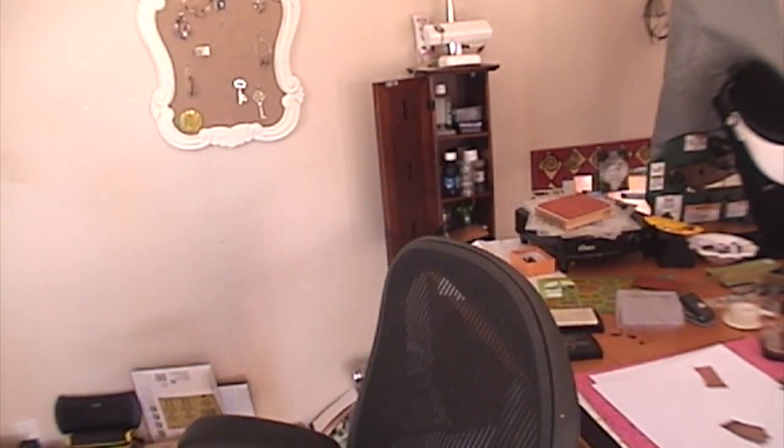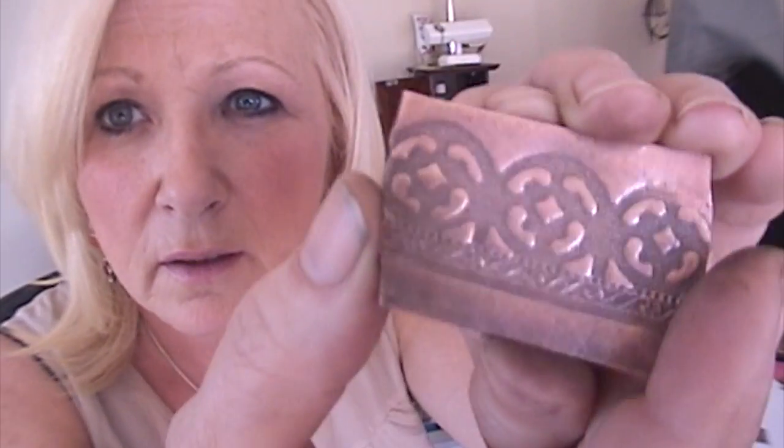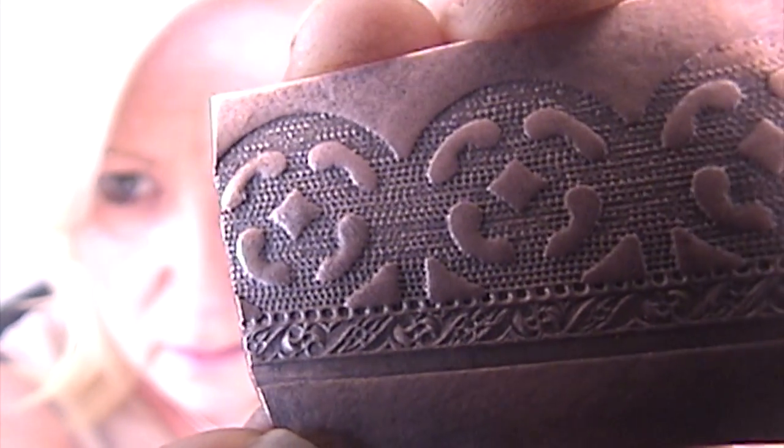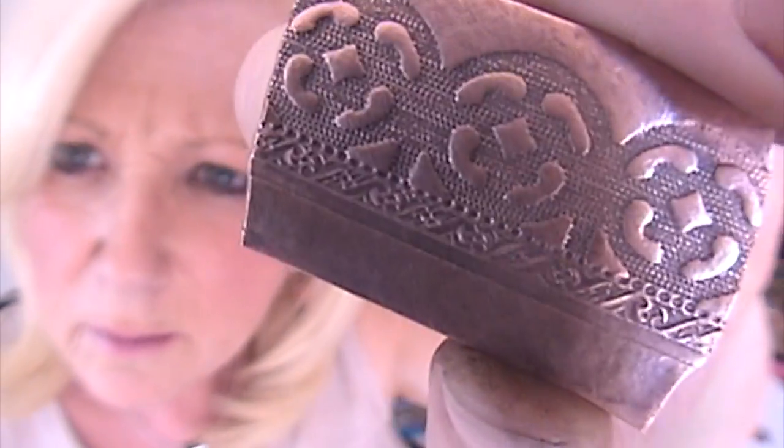Some of you have been interested in textures I've gotten with lamp banding. You usually buy it in one-foot strips from lamp banding suppliers — it comes in steel or brass. I have one pattern here; I just cut a little piece off and put it through my mill. This makes some very deep, thick textures which I love. You can actually even see the detail in the grid screen in the background. Lamp banding rocks — it's really, really good. It's great with sterling too. For 18 gauge I like to use something thick, but for 20 gauge the lighter textures work well. There's a lot of detail — pretty awesome.